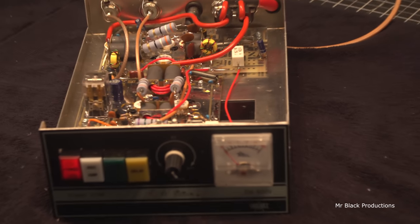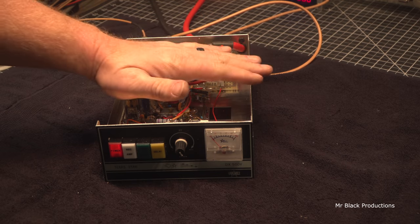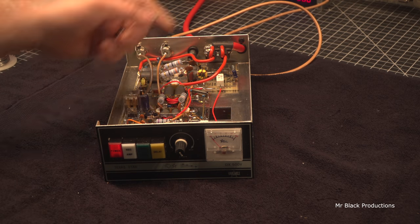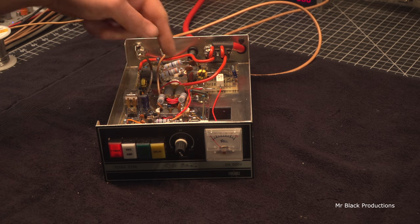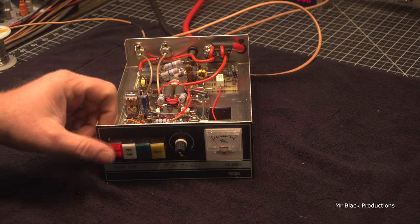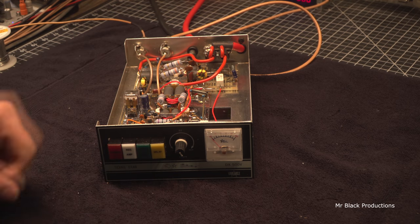Let's come back over here. Now, what's the one thing we got left to do? We're going to flip the amp over. We're going to mount a 120 millimeter fan on the top. We got this little grommet here in the corner. We'll run our power wires for the fan in through here, and we'll plug on to the front end of the switch over here. So when you turn the amp on, the fan will turn on.